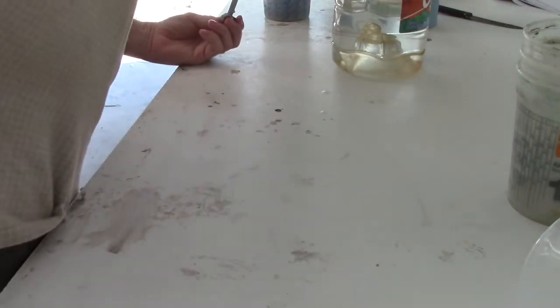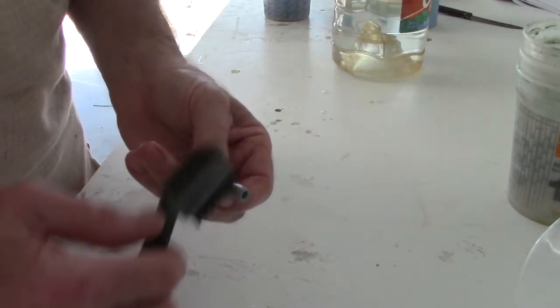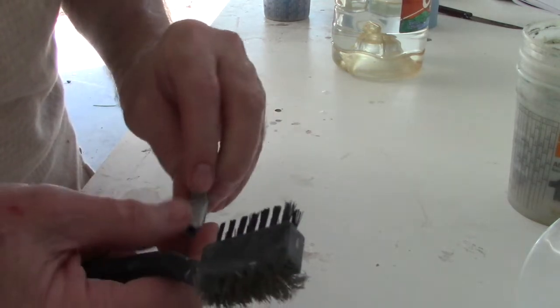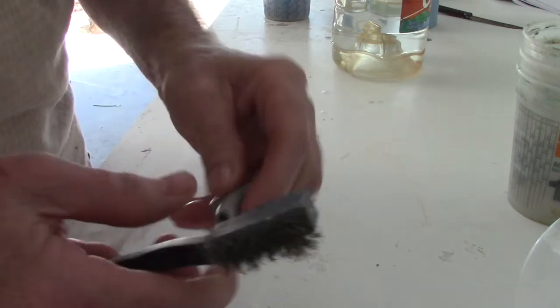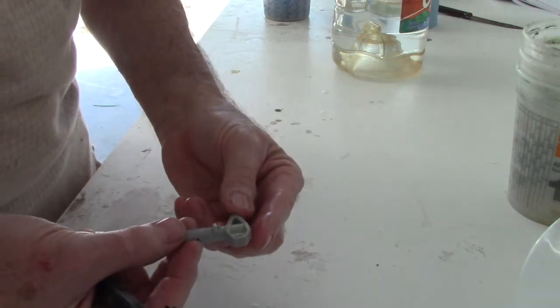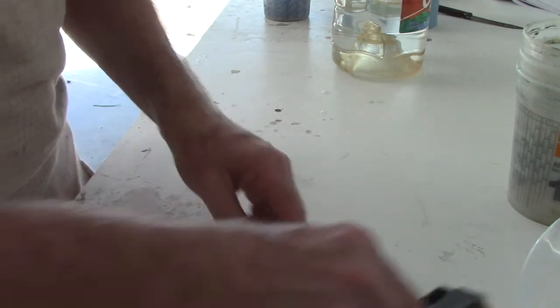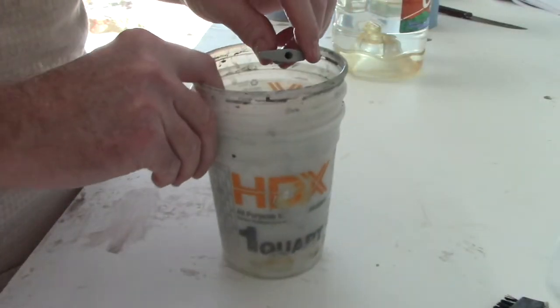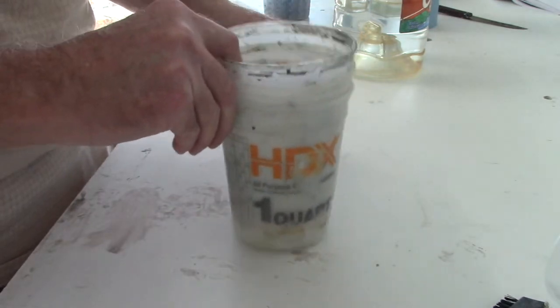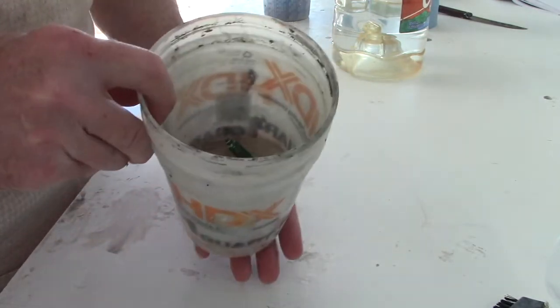With their tiny orifice, spray tips are vulnerable to clogging. No matter how well it is cleaned, once a tip is placed in production, it's a good idea to store it submerged in solvent. We keep ours in paint thinner or mineral spirits to help ensure that the tip doesn't get blocked. Once a tip is clogged with hardened material, it's next to impossible to open it up again.